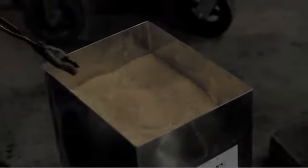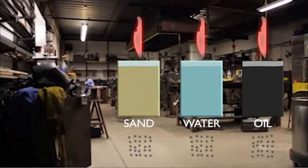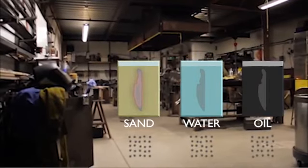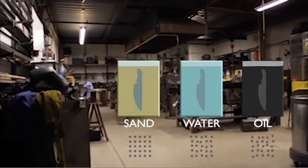It will cool at a much slower rate compared to room temperature or other methods, such as quenching it in water or oil. Newton's law of cooling states that the rate of change of the temperature of an object is proportional to the difference between its own temperature and the temperature of its surroundings. Air bubbles are trapped in between the grains of sand and insulate the heat radiating from the hot steel. Thus, it slows down the cooling process considerably.